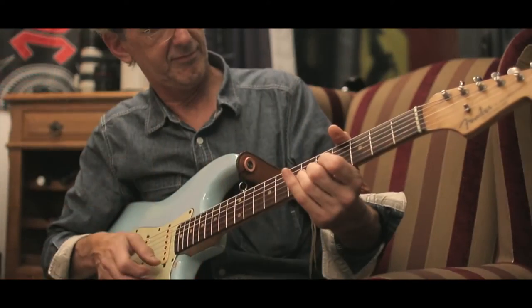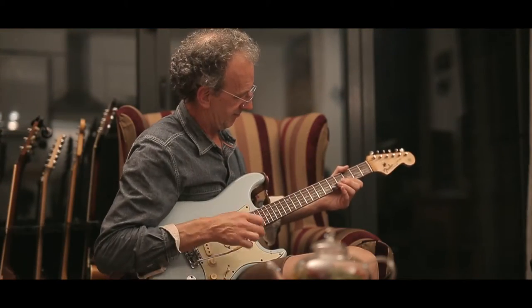But before five-way switches came in, what people used to do quite a lot, they would either add a mini toggle switch, or sometimes even another three-way switch, so that you'd get one three-way switch and next to it a new three-way switch. So by using the two three-ways together, you could get all the combinations that you can get in a five-way switch. And I guess that's for guys, because even with those three-way switches, you could still jam them into the in-between positions.